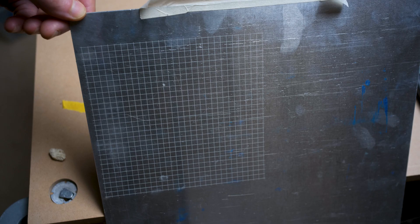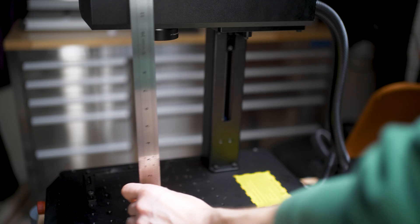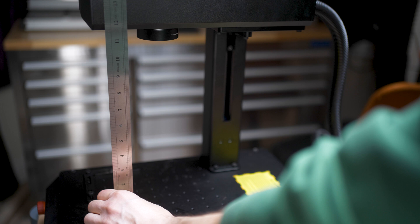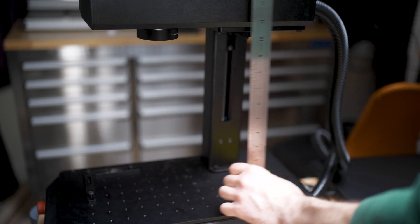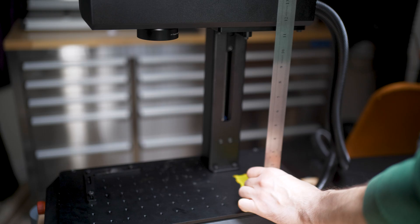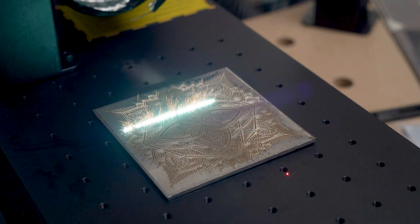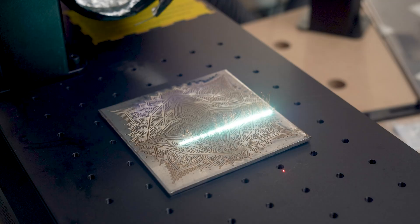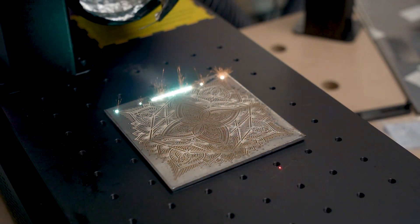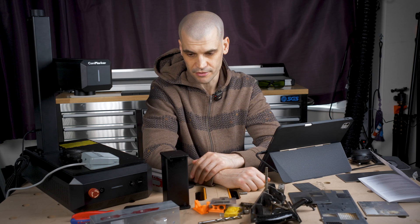When you use the riser, you will need to go through that calibration again. Honestly, just using a ruler and measuring the front and back distances and getting them within about one millimetre is probably going to be good enough. Once calibrated, I could start doing some engravings, and I've been very impressed with the performance. The autofocus is probably one of the big unique selling points of this model and it works really, really well.